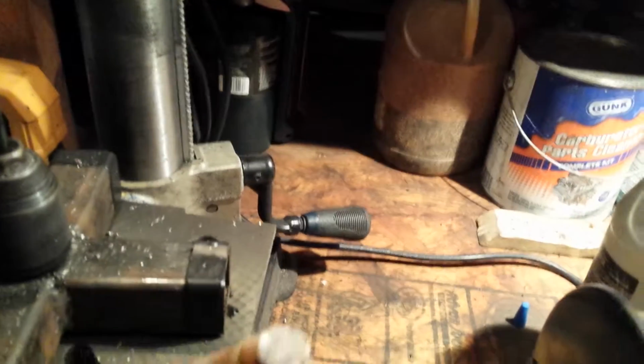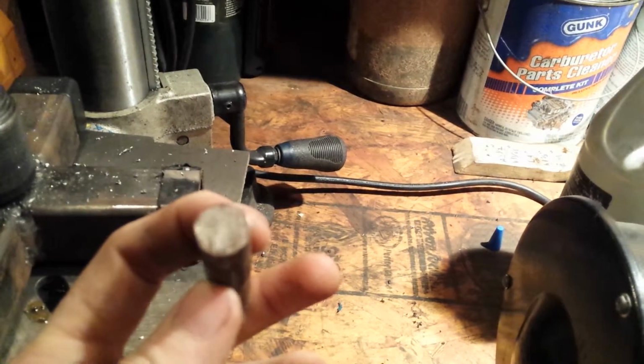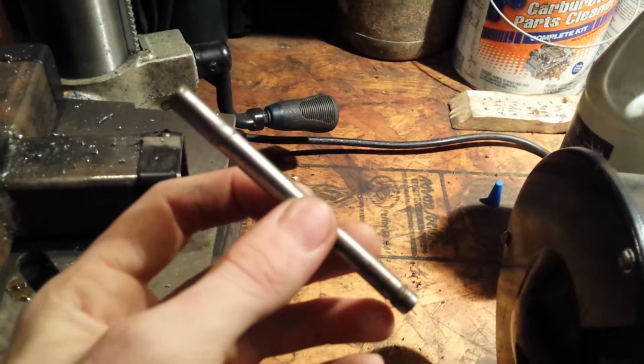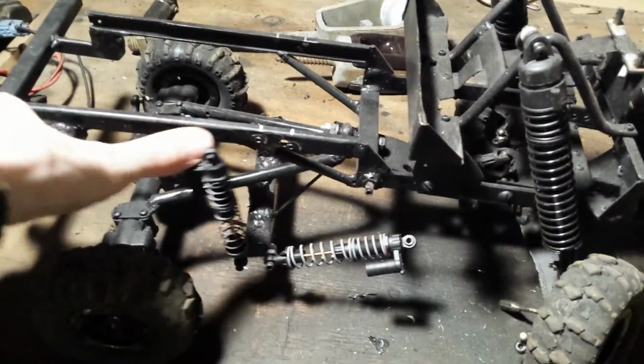Alright, tonight's project. I need to make a 5/16 inch hole as close to center as I can get and as straight as I can get in a piece of 1/2 inch ball stock. Purpose, so what used to be a valve stem will fit nice and snug in it, and we'll have little to no play.